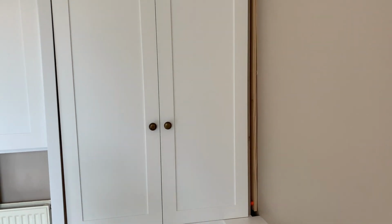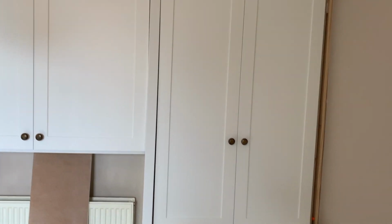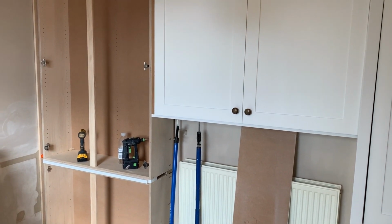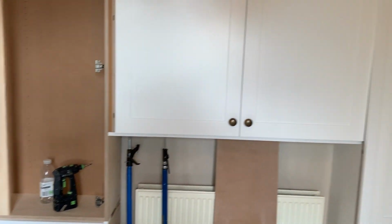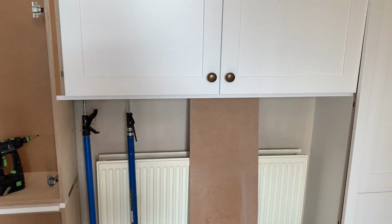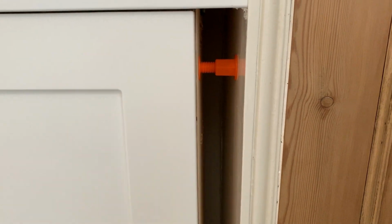Now, part of the driver behind deciding to do things that way was when we first were making cabinets, we were painting everything, including the internals, and started to get feedback from a lot of customers that they really weren't too bothered if the internals were painted. So we standardized our pricing as being unpainted, with the option of people upgrading to painted on the inside. We pretty much always offer painted on the outside, but what the inset hinge method means is that you can fully conceal the carcass, because in some cases, when you're using overlay hinges, sometimes that edge just becomes a bit too visible.